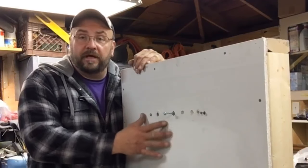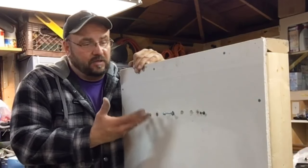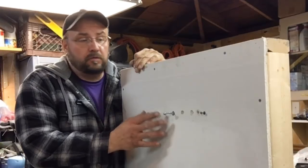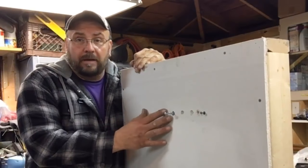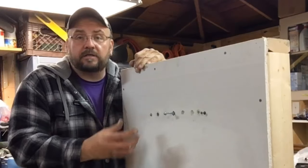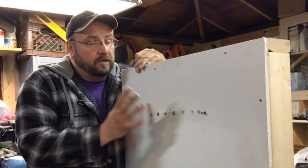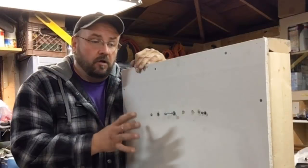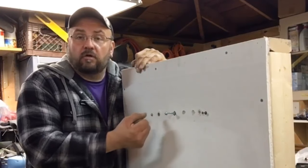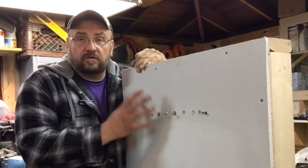That's about all I've got for this video — I hope it helped. There are many different kinds of wall anchors; I just wanted to touch on the most common ones. These are not for mounting a TV — I want to stress that. Also, don't use these for grab bars. If somebody's handicapped and holding on to a grab bar, those need to be mounted to a wall stud or wood backing to handle the weight of over 200 pounds — and even greater force as you're falling. These are not for TVs or grab bars.